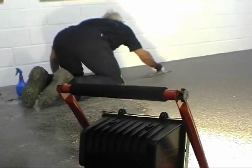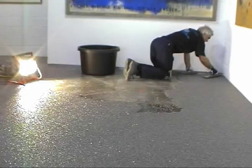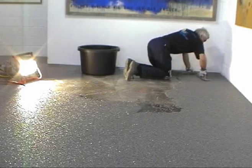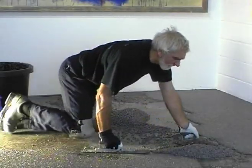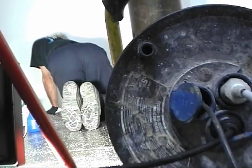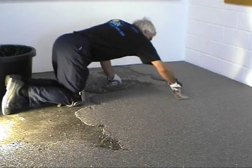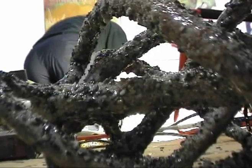After the installer's first spreading stroke, the system will remain open, but as the installer continues the strokes, the system will compact tightly. The trowel should be tilted slightly to avoid opening up the system. The trowel should be turned around during the final compacting and polishing strokes. You need to press firmly down on the trowel to achieve maximum tightness and an optimal smooth finish.